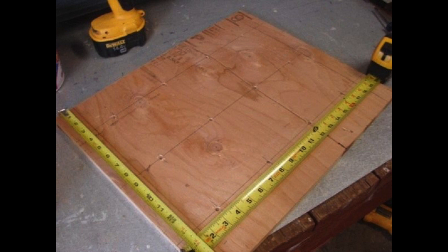Cut 2 pieces to 22 inches each for the top frame's left and right sides, one piece of 1 inch by 1 inch x6 wood — cut 2 pieces to 18 inches each for the top frame's front and back sides, one piece of thick plywood cut to 16 inches by 20 inches, 12 big mouth quart-sized jars for the honeycomb, one box of 1 inch wood screws, and one can of any dark wood stain.